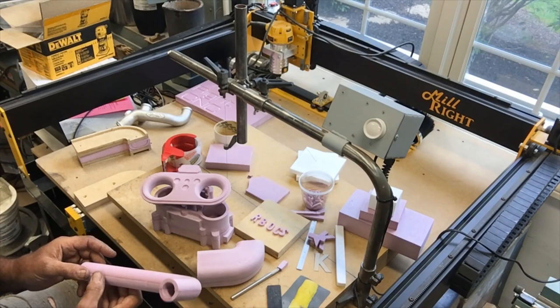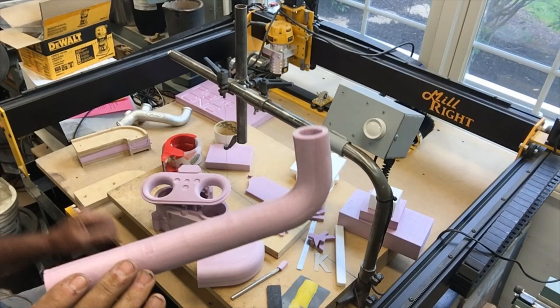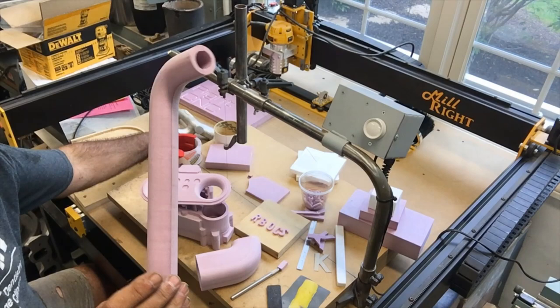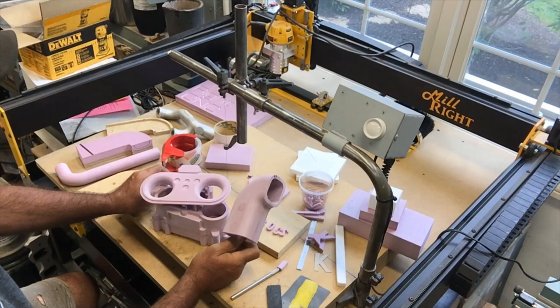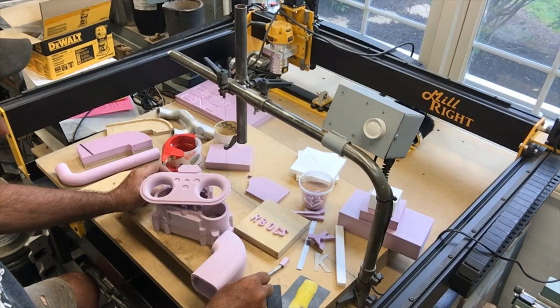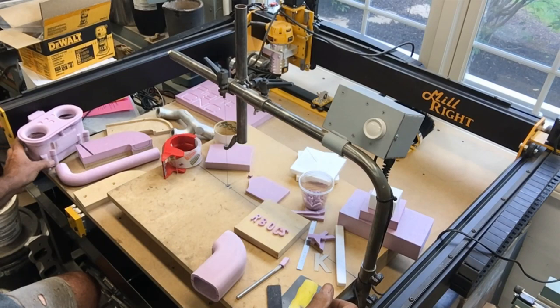This is an example of something I've been making for a long time. I made patterns to make these one-and-a-half-inch quarter-wall tubular elbows, then cut them up and stick them together in different shapes. This is an example of an automotive water neck for getting coolant out of a racing engine intake. I make a whole bunch of these, cut them and stick them together like plumbing, and lost foam cast them. If you tune into that intake manifold video on my channel, you'll see you can assemble a pretty large, complicated pattern with fairly unsophisticated methods. Granted, in the future there are a lot of things CNC does way better — speed, accuracy, and complexity of shape — but with some patience and desire you can make some pretty interesting patterns.